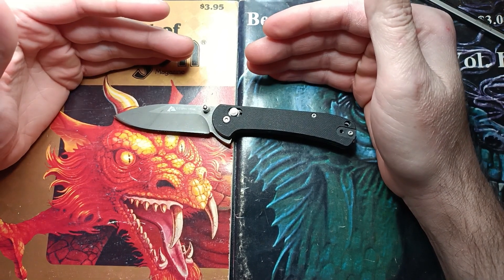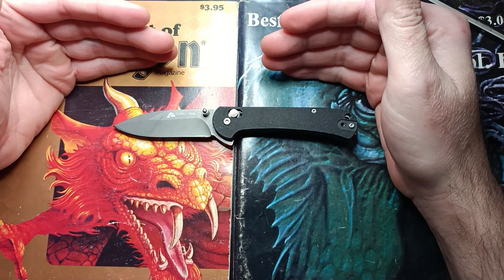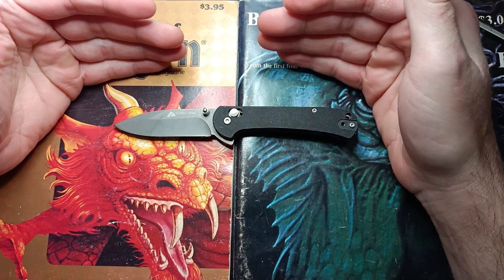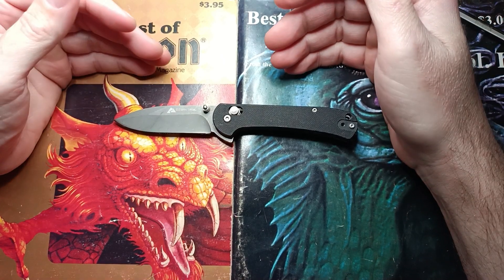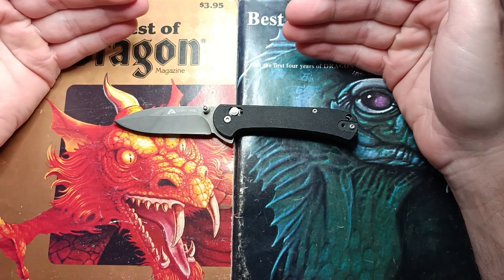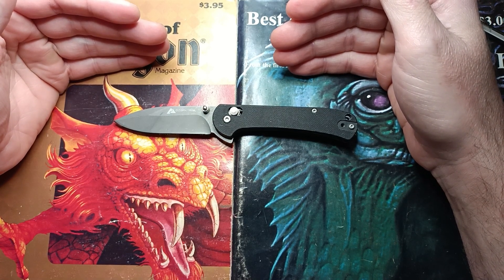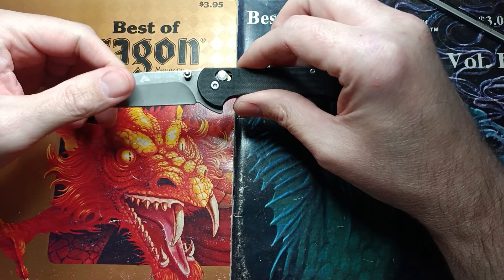One of the reasons I did this is I'm still learning things. I'd seen repeatedly online that edge geometry is kind of the king of how your knife cuts and holds up. I had an intellectual understanding but a mental disconnect because I'd never had my hands on it — I don't learn nearly as well from reading as from getting my hands dirty. We'd guessed maybe an hour and a half out of this before it went dull, since it's the same steel and 18 degrees didn't seem far from factory. But it ran three hours and could have easily gone four.